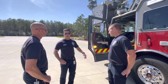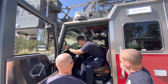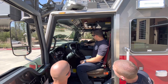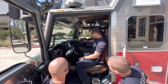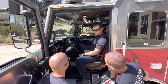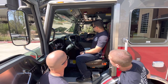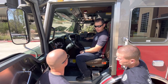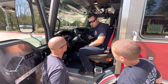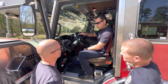I'll show you what it's supposed to look like. This is the aerial master, aerial PTOs, generator PTOs, and the front wheel lock. When you press each button, they're going to light up. They'll turn red because they're active, and this one will turn green, which means the lock is on. The last step will be the high idle — when you hear the motor, the RPM goes up, which helps in aerial operation.